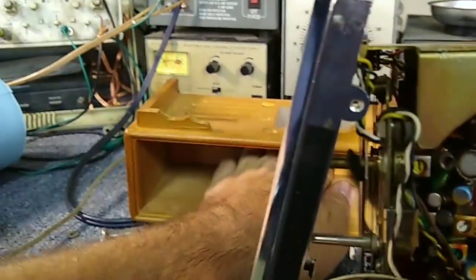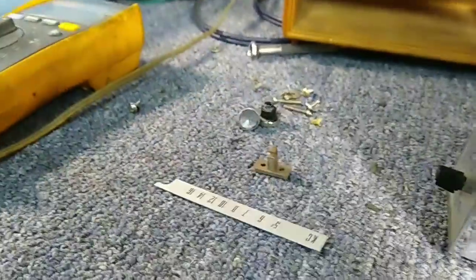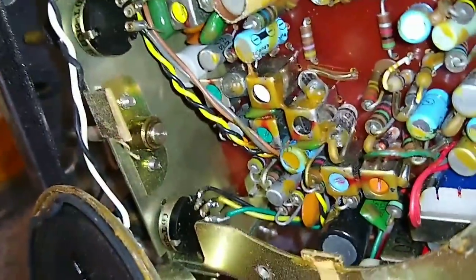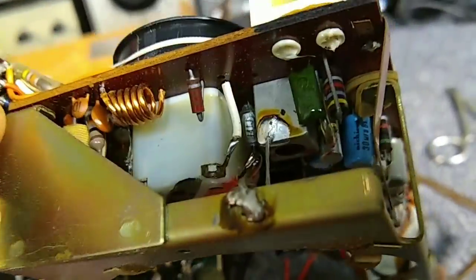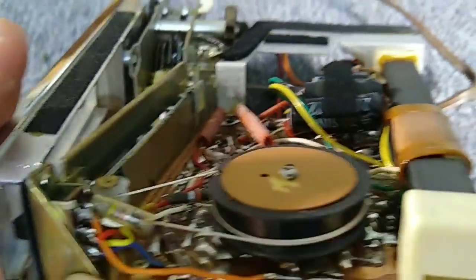Because with a big whip antenna like this had, it should do something. The whip antenna attaches here, pressing against that bracket back there. This thing that fell out of the cabinet — I'm guessing it's a cord holder or antenna holder. More stuff to reattach. These are tiny, tiny little potentiometers — look at how tiny that is. Things this small were really not of this era yet, so this was probably an expensive thing. The non-fun part is troubleshooting, because without pulling that board up there's limited room, but if you pull the board up you've got to de-string the radio, which is not very fun.